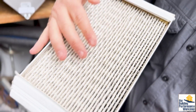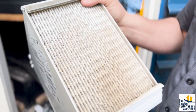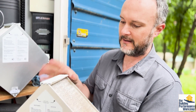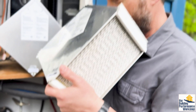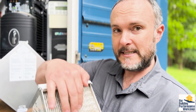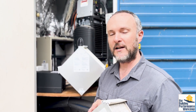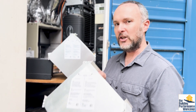What I want to show you is this is the outgoing air — stale air coming through and going to outside. This is fresh air coming in and going to inside. And this is where we have the issue: cold and also the humidity. Both of those spikes are going to hit right here first. This growth might be an issue. If that smells like something you want the inside of your house to smell like, then great. The problem is that I installed this in the wrong place — this is in an outside cabinet, the same as if you were installing this ERV in your attic or in your unconditioned crawl space. This will happen when you have the ERV located in an unconditioned space, so don't do that.